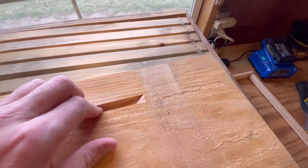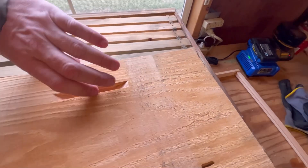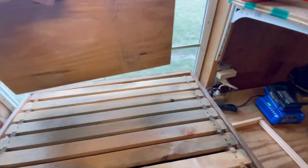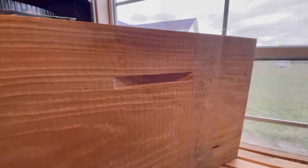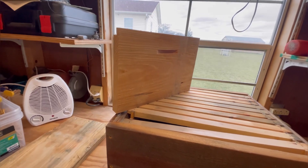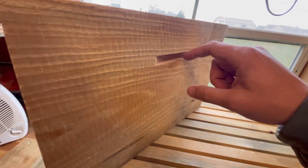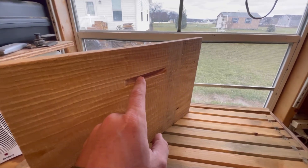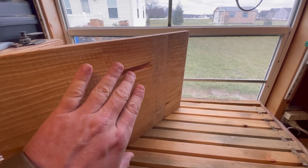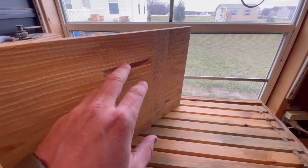Last thing is our handles. It's 2 inches from here to here. We run a four-dado blade set, which creates a half-inch gap. If you're going to paint your boxes, this handle design is a terrible idea — reason being, when it rains, water will sit right there, and anywhere you have exposed end grain, that's where rot will occur. We wax-dip all of our equipment, so I can make my handles like this and water will just pool all day and will never cause rot. That's why a lot of commercial bee handles have that hollowed-out, sloped cut at about a 15-degree angle so water doesn't pool up.